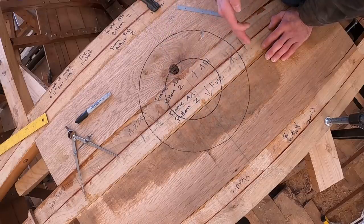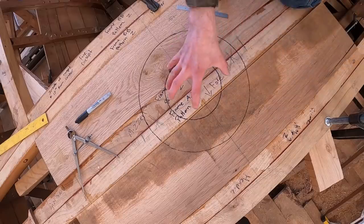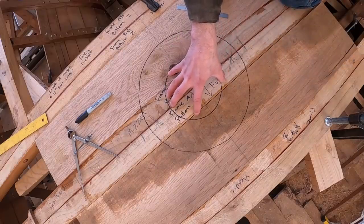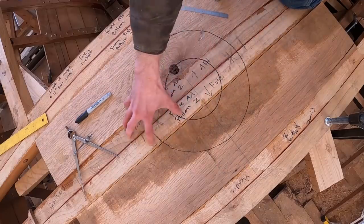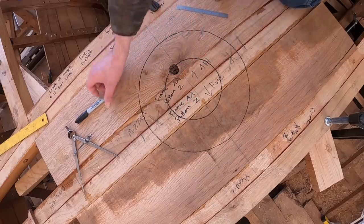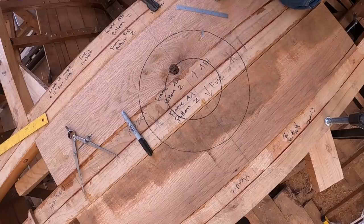Now this gives us where we can put our bolts. And if this isn't quite where it needs to be, it's gonna move forward or it's gonna move aft along the center line. The mast here is not gonna move port to starboard. So we can put the bolts pretty close to this and know that we're gonna be outside of it and that we're gonna be safe. Because like I said, it's just gonna move fore or aft and that won't affect the bolts at all.